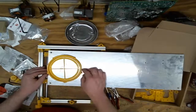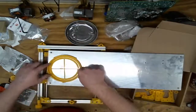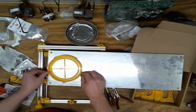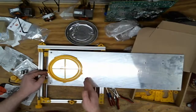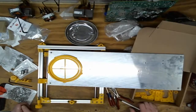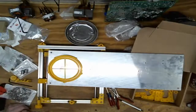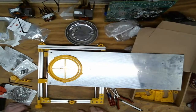But at the same time, this bottom plate gives this support. So when you're doing your squeegee, you're pushing down on this. So I think I do want it on the plate. So I'm thinking I make the plate exactly that wide. About there for this rotational assembly. It will bolt on, you know, split the difference between these two bearings just sort of like that. I'll drill and tap the back side of the plate to screw these to it. And I'll just transfer those. And then there's a bunch of other pieces that go.